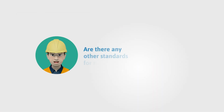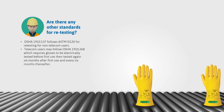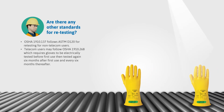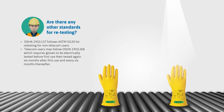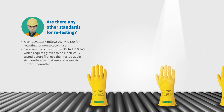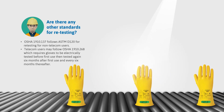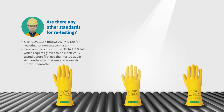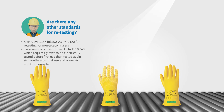Are there any other standards for retesting? OSHA 1910.137 is in line with ASTM D120 for non-telecom users. Meanwhile, telecom users may follow OSHA 1910.268, which requires electrical testing before first use and further testing again after 6 months and every 6 months thereafter.